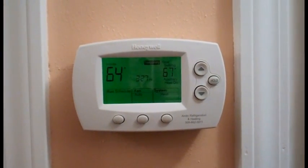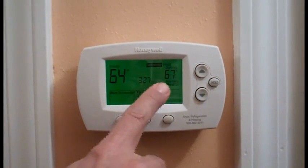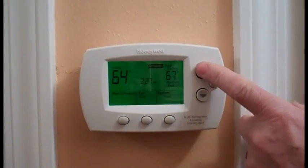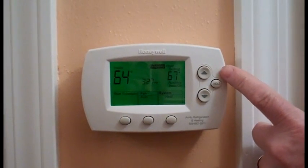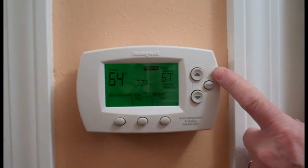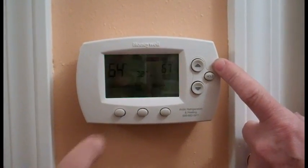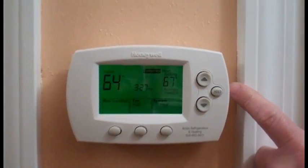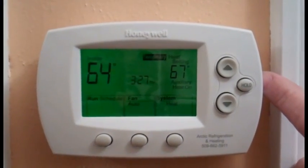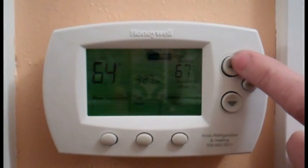What we're demonstrating now is that the set point of the house is 67, the control point is 64, so the house thermostat says it needs to turn the heat on. We just came from recovery mode — it's trying to warm up. Notice the heat pump is no longer just a heat pump; it's got auxiliary heat on at the same time.